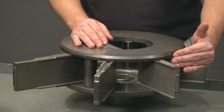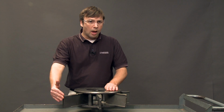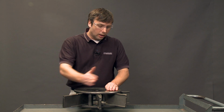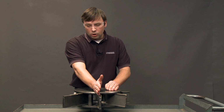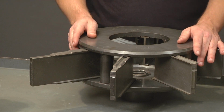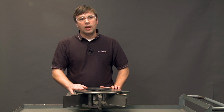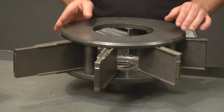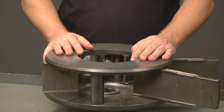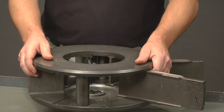The shorter the blade, the more abrasive flow. The longer the blade, the greater the velocity, but the less abrasive flow per minute. Again, that's 200 feet per second, 240 feet per second, 260 feet per second. Wheelabrator has a wheel, whether it's the double-sided wheel or the single-sided wheel, high speed and low speed alike, to meet your application and improve performance, coverage, life of your parts, and the efficiency of your blast machine.